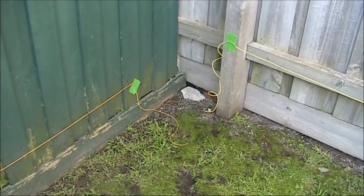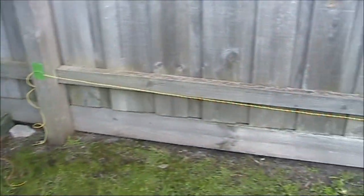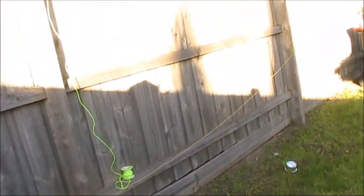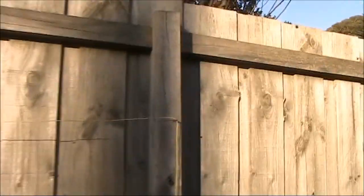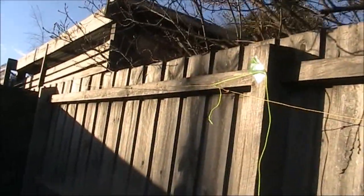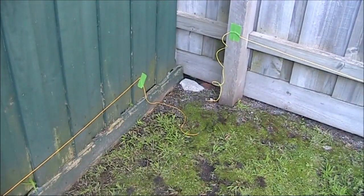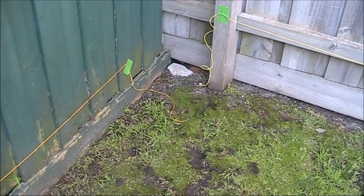Just so you can picture the antenna — this is the feed point. You can see the two ends of the yellow wire down at the ground. It's running along the bottom of the fence. You can follow the wire as it goes up to a corner. I've cheated a bit — I haven't gone right up to the top of the fence; I've just used a nail I had in for another experiment. Then following the wire along the top of the fence, we're back to the corner, and it's drooping a bit on the other side, 90 degrees from before. Then it drops down and runs along the bottom back to the feed point. That's a perimeter of 30 metres, or one wavelength on 10 megahertz.